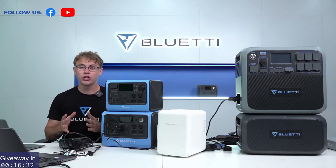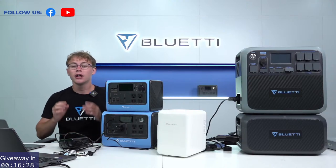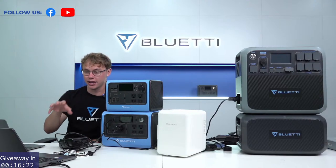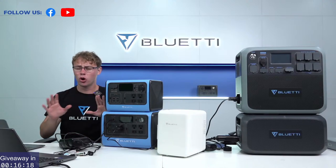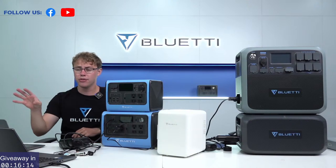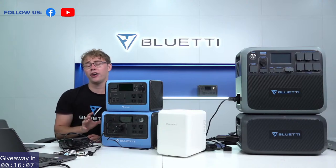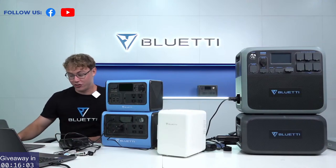Make sure that the open circuit voltage, or VOC, of that solar panel is in the range from 12 volts, not lower than 12 volts, and not higher than 28 volts. And the input current is 8 amps max. Don't worry about the input current. Your solar panel input current can be anything, the amperage limit here is 8 amps, so it will not go higher than 8 amps. You just have to understand that. And the input power is 200 watts max.